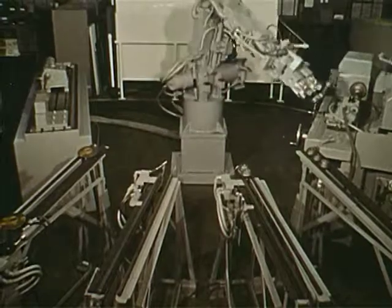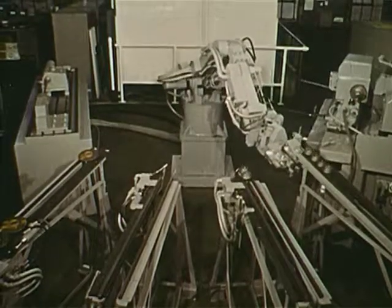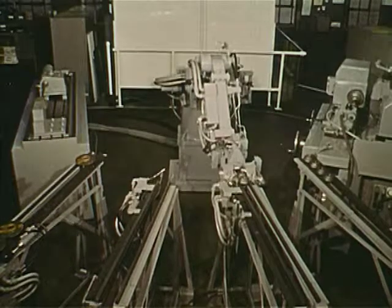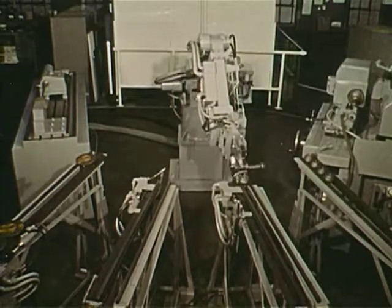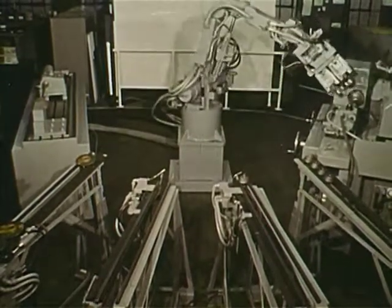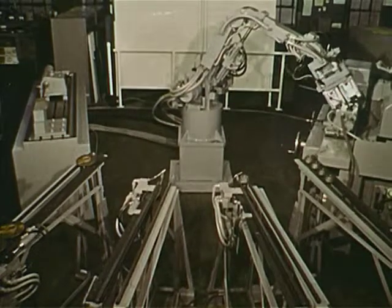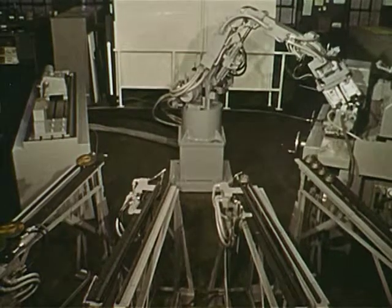Most machinery is designed to be loaded in a horizontal or slightly vertical direction. Many times splash guards or other obstacles must be avoided during the operation. The jointed arm concept with the straight line motion between programmed points makes establishing the proper path an easy matter.